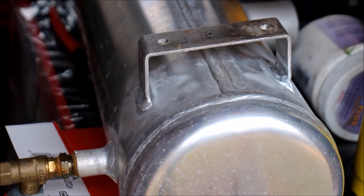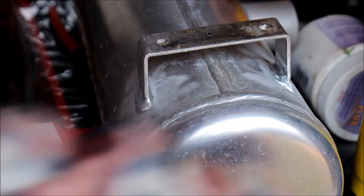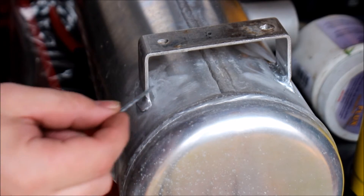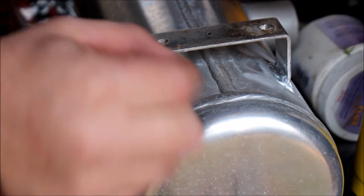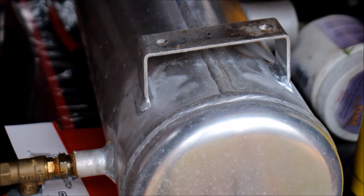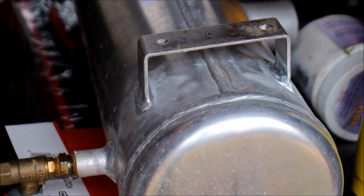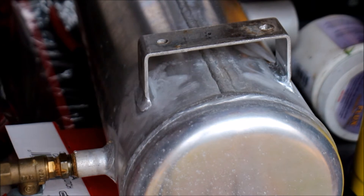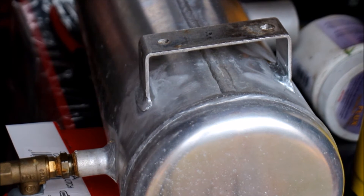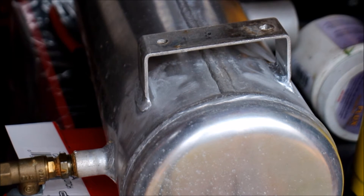I got a little practice here. You have to heat the heck out of it — that's kind of the first thing. And then you have to use the rod to kind of force it to stick almost, because inherently it really doesn't want to stick. It's not like solder that'll just puddle and flatten out; it really doesn't want to do that. I've got assorted sized rods here, so we're going to see how they all work. But you've got to keep the torch on for a long time and make sure the whole thing is really evenly heated.